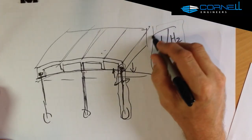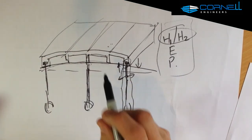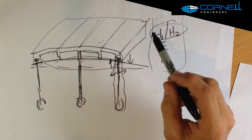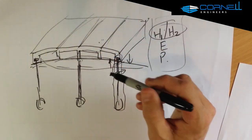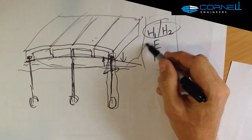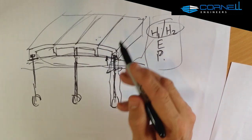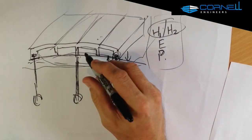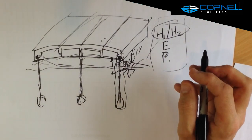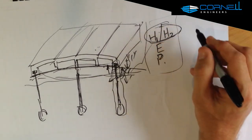There is no justification for designing a waffle slab for a lower soil classification simply because you're supporting it on screw piers. I'd caution any designers out there saying 'we're using screw piers so we're going to design for H1 or H2' — whether it's uplift and heave or consolidation, one way or the other the foundation system still needs to stand on its merits. If it's consolidation of loose soil then screw piers really come into their own — the ground can settle away from the underside of the foundations and the building will be supported on appropriately designed screw piers, a gap forms, and that's fine. In that case we're in a position where we can fill that gap around the outside.